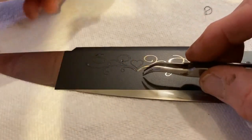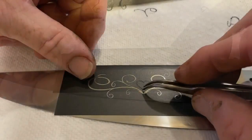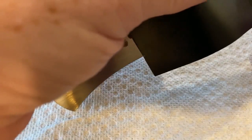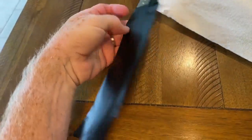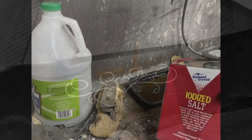If you've never done metal etching before, basically everything covered with the vinyl is not going to get etched, and everything exposed is going to get electro-etched. Now that I've completely weeded the area I want to etch, I'm going to protect the rest of the blade by putting additional vinyl on any exposed steel — behind, below, and in front — and I'm also going to cover the entire back of the blade. The purpose of this is that when it's sitting on a wet piece of wood with electrolyte solution, I don't want any electricity going through and etching the wrong side of the blade.